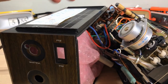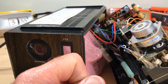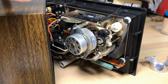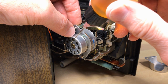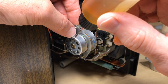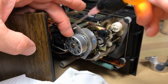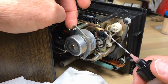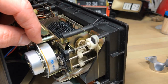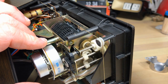It's all about this motor. We've got to get this moving freely so when we get it back to Marsha she can plug it in. That's open household current there — I've been real careful; I could have gotten shocked. I'm going to show you how you're supposed to oil this: take a drop of oil and drop it into one of these holes, aiming it down towards the arbor — that axle. You can use synthetic clockwork oil or synthetic motor oil, you really can. One drop, give it a few spins — do that several times and also let it run overnight. I'll also hit this metal post with a drop of oil, and touch some of the metal gear arbors lightly. No need to over-oil.